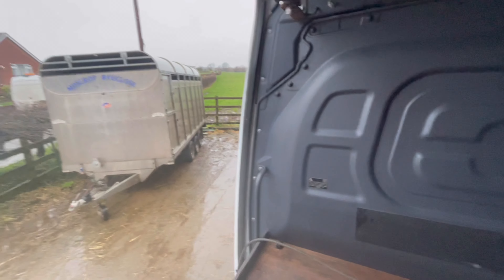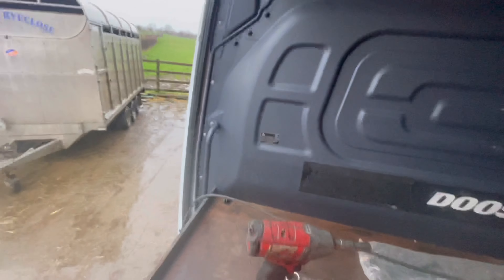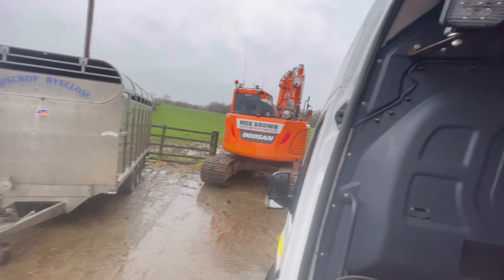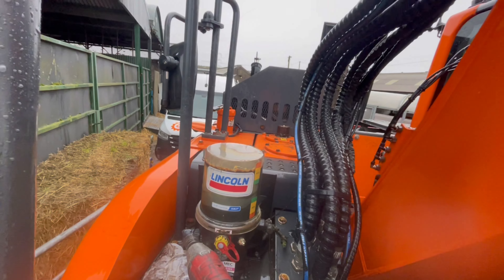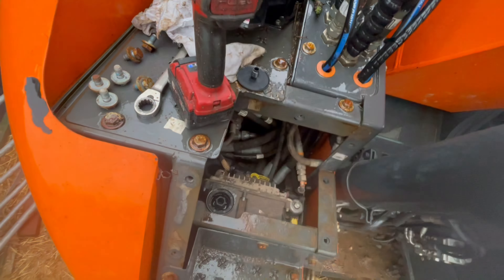There we go — it looks stupid, but it ain't stupid if it's saving this man the cost of a sensor, believe me. It ain't stupid if it works. There's some laptop work to do at the end once I've got the machine serviced — I just need to make sure that sensor's working as it should and reset the error codes. I'll put the cover back on and get on with the service. If you've got a 140-5, whether it's an LCR or LC, get one of those Sparex exhaust flaps — I think it's 75 to 100mm diameter, about £13 to £15. This could save you a fortune. Now on the subject of AdBlue, I'm going to replace the filter — that's part of the service.